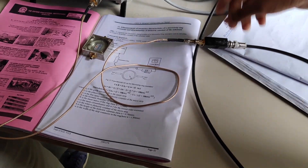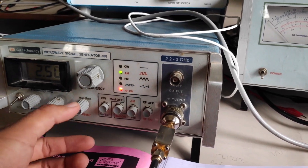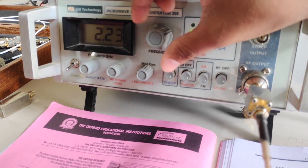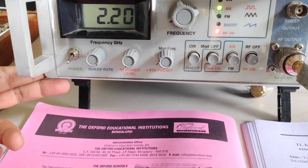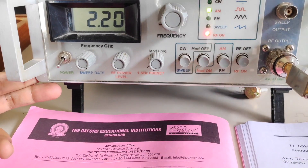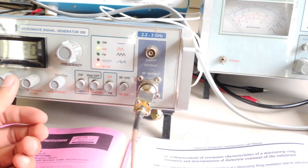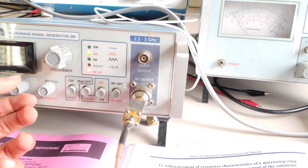The first part of the connection is done. So we will turn on the microwave signal generator. We will set the first frequency to 2.2 GHz. Then the modulating frequency — we should set the modulating frequency such that you get a sound: 1 kHz. So now it's set. You have to set it to 40 dB, and using the reference power level, you have to set it to 45 dB — so 5 dB. This is the reference knob. Keep increasing until you get 5 dB on the VSWR meter.